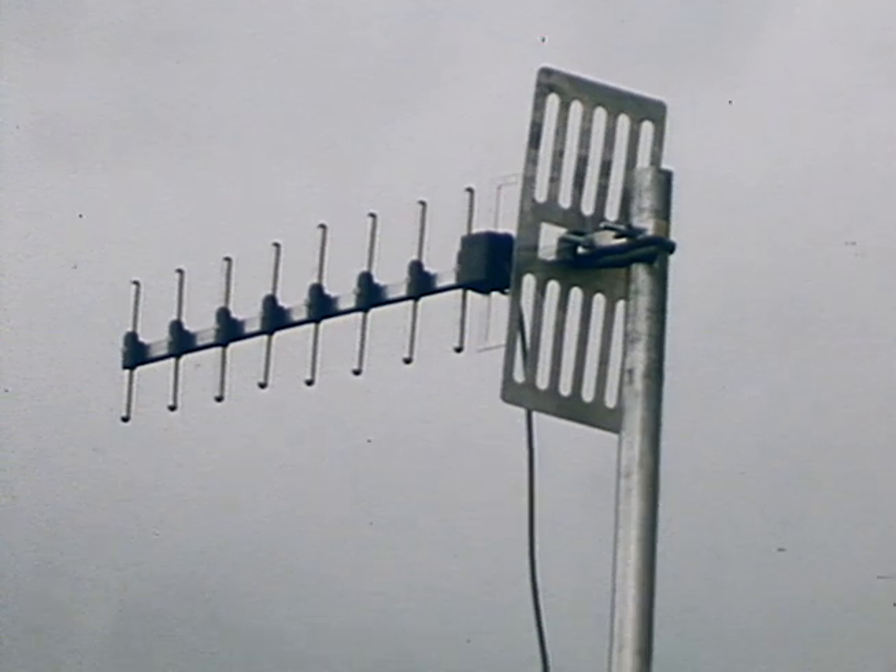WISP carried a simple commercial camera, whose sightline stability was derived from the air vehicle stabilisation. The symmetric planform layout gives the vehicle no preferred direction of flight, permitting it to point its narrow-beam data link antenna continuously at the ground station.